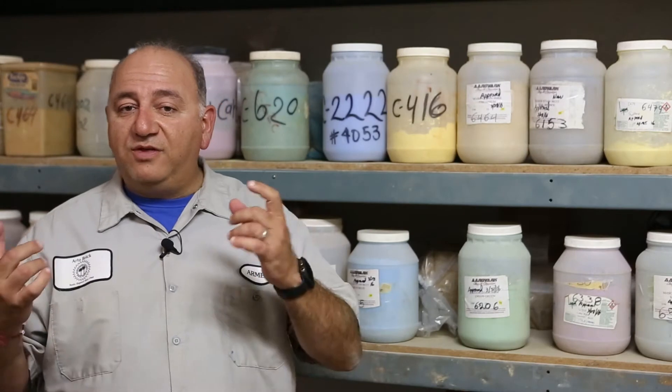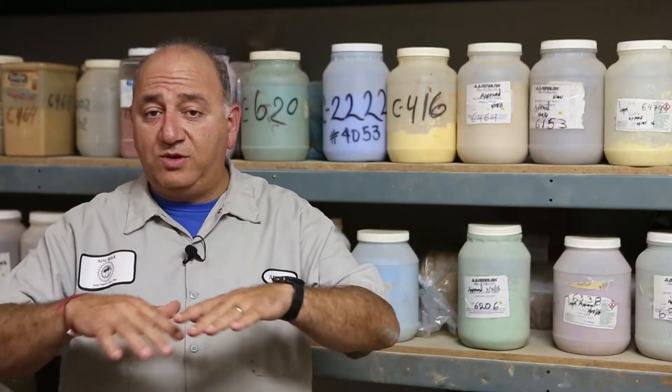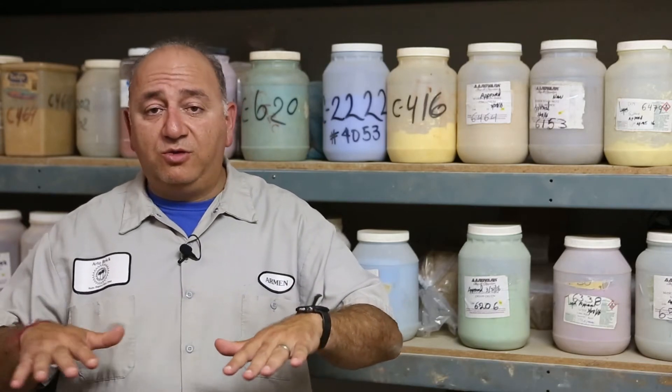Can you use the signature on the floor? The answer is yes. You can have the glossy colors in a three-by-three or an arabesque pattern used on the floor. The issue is having a larger area of unbroken tile with no grout joints — you're going to touch a tile and fall on your rear end.